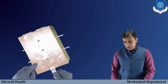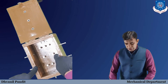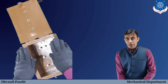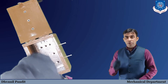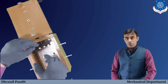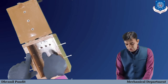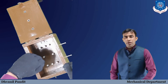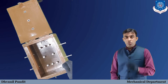If I open the box, you can see the top plate or jig plate, the base with locators inserted, and the vertical sides — four vertical sides. One side is intentionally kept open for loading and unloading. From here we can load or unload the workpiece between the locators. We have placed 8 locators in this model.